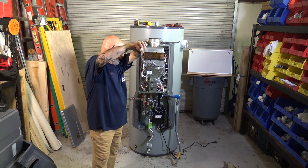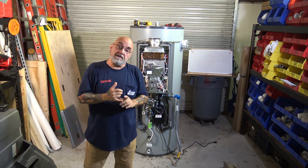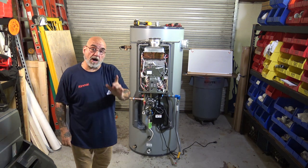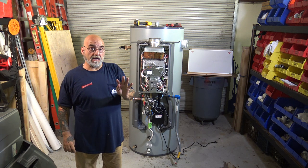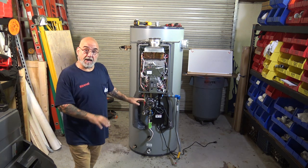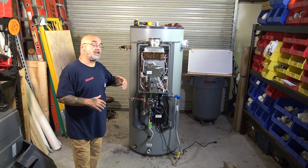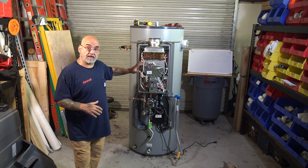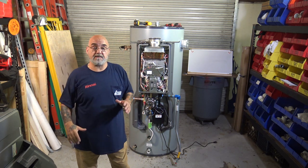and the controller and tankless will cycle the pump. Now, it's important that you have only 1.3 amps going to it, and the pump for this or any demand duo needs to be no more than 4 gallons per minute, all right? If not, you can wash out the bottom of the tankless and it will not operate correctly, will not heat correctly. And I have gone to numerous service calls with demand duos that other contractors installed that had massive pumps pumping 24/7 into the system.